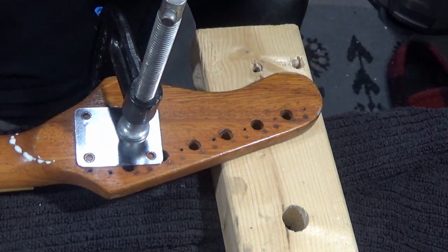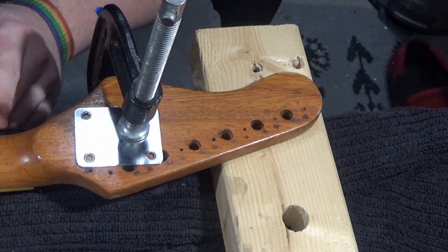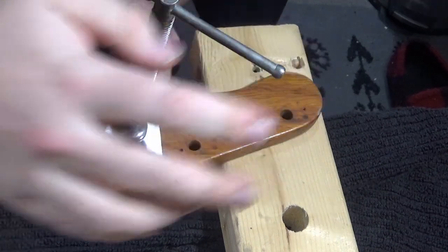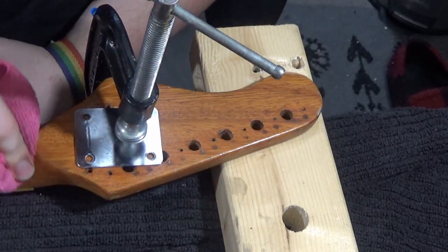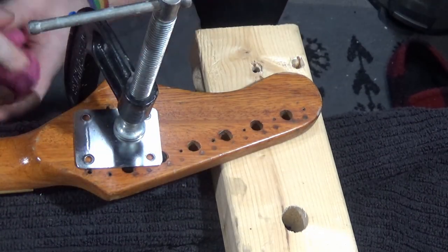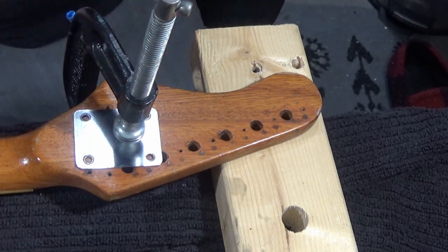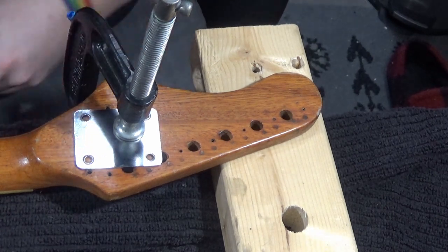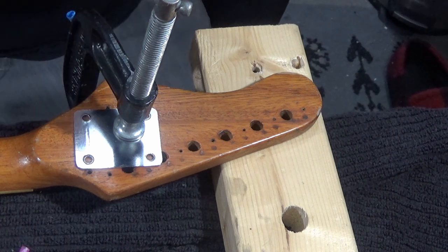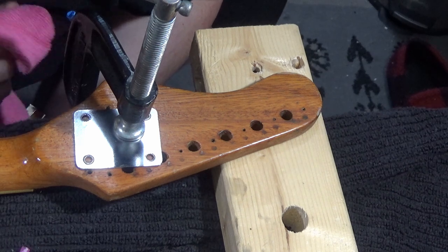Okay, I feel resistance, and that's when I'm going to stop. This crack looks pretty closed up. It can still close farther because there's still squeeze out when I tighten it, but I've got about 20 minutes of open time before it starts to really set at all. Okay, there's still a significant amount of squeeze out happening, so I'm calling that good. This is going to dry for at least 12 hours before I take the clamps off. So I'm going to call this good.